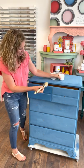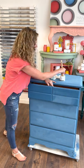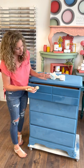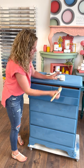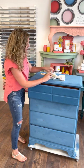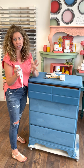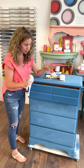I'm going to go ahead and get a bit more wax and do the other half of the drawer. A really nice thing about our beeswax finish is that if you get called away mid-project, it's not going to leave you any start and stops. So if my kids call me or whatever and I've got to go do other things, I'll be able to come right back to this project and just start waxing again — it's not going to show that I left halfway through. Also, don't be afraid — it looks like the paint is coming off, but it's actually not. It's just the dust from sanding, and that's what's coming off on our rag. It's not actually the paint color coming off.